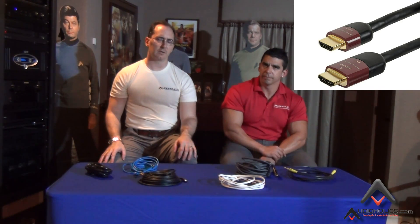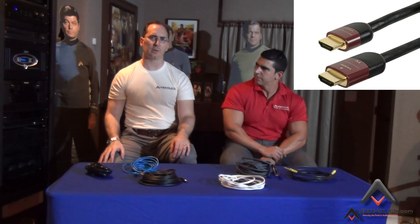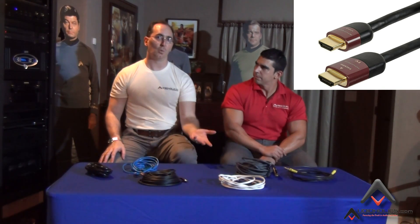For the projector, we ran conduit. We knew where the projector was going to go, calculated the throw distances, ran conduit, and snaked in not one but two HDMI cables — because if you get one kink in a cable, it could be the end of the game. Once the drywall is up, you can't change it, so it's always good to have redundancy. With HDMI there's a lot of snake oil, but it is important when running 30 to 40-foot lengths. You can go up to about 50 feet before needing an active solution or fiber. Try to choose an HDMI cable that is category one or preferably category two rated, as it handles higher data rates and beyond 1080p.